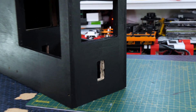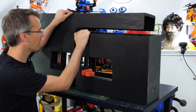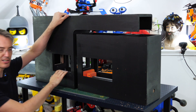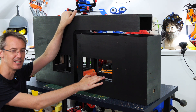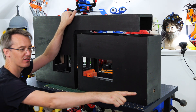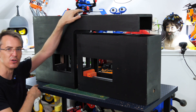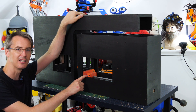The other half of the axle goes into the square holes in the other half, so the two halves of the bike can split just like the hoverboard. The axle is fixed into one side and on bearings in the other. Now we need to put some axles on the ends and put the wheels on. With hindsight I probably should have had one axle running all the way through, but I didn't think of it, and now my wheel axles are too small — I really wanted a fat axle in the middle.